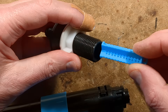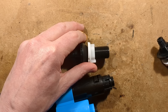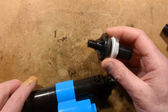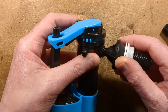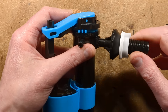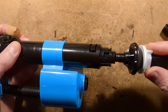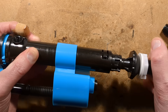That goes in the bottom here. You choose your pipe size — the smaller size or the more standard half-inch size. Then you decide: do I want it coming in the side of the toilet cistern, or from the bottom? If you want it from the side, you screw it into the side port, and in doing so it pushes a little plunger in and opens the water valve. Or when you take it out again, there's that little plunger which stops water from coming out when you use the other port. If you want to go in the base, you screw it in here.